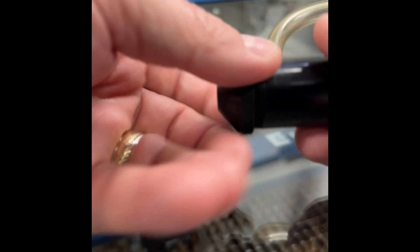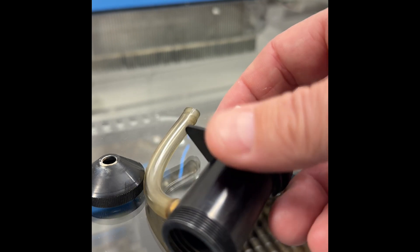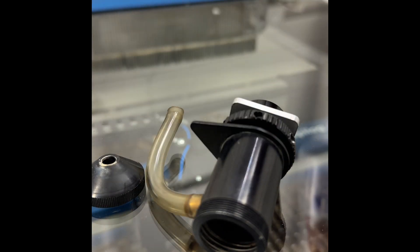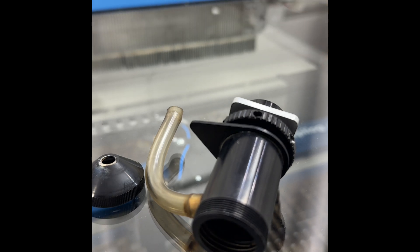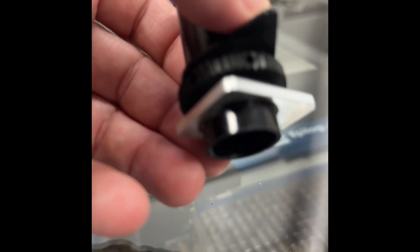I'll take this cap off. As I remove this cap, you'll see that there is pretty much just the bottom and that's it. The idea is that you would take some Epilogue lens cleaner and some q-tips, put some lens cleaner on the q-tip, and wipe the bottom and the top of the lens clean and dry — super shiny and clean. That's the way you clean this lens assembly.